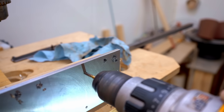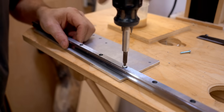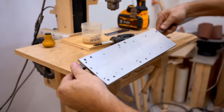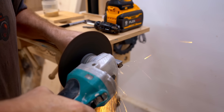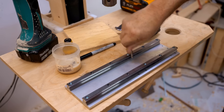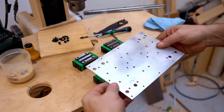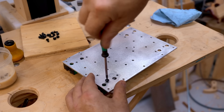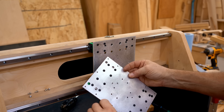The holes I'm tapping are two different sizes — I've got 8-32, and that's the size bolt I'm using to mount the linear bearing rails. I'm going to get one temporarily fastened so that I can mark the length accurately and then cut them off. I confirmed that these rails are straight, and when I put them on I check to make sure that they are parallel to each other.